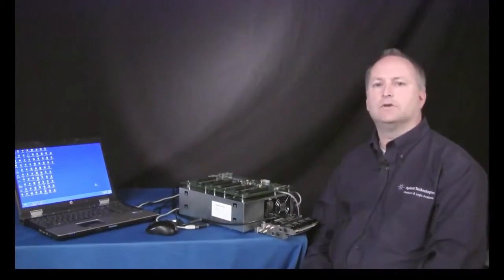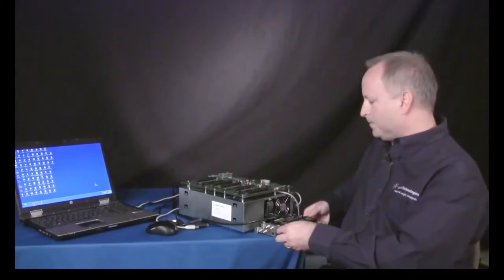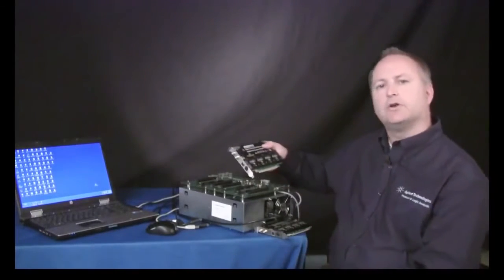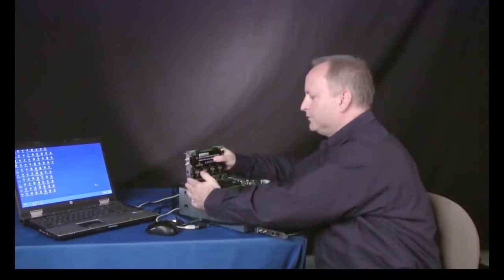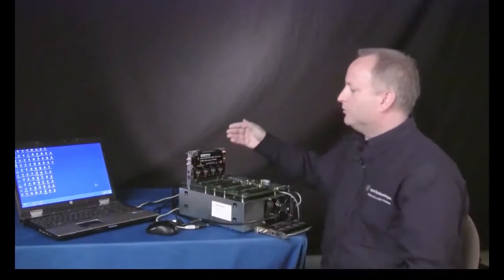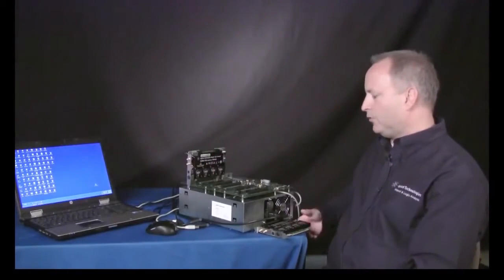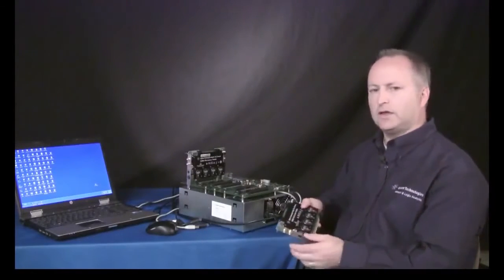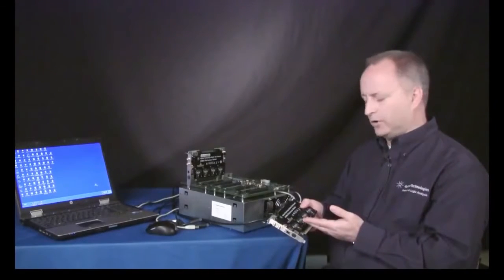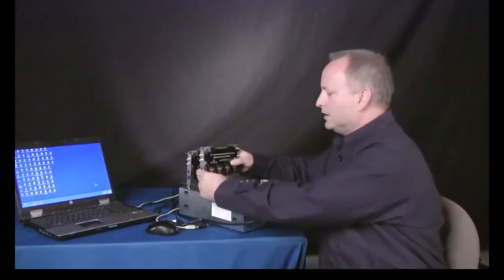In order to run the PTC3 tests, you'd use the backplane, our N5316A, as an interconnect between the U4305 configured as a PTC3. The backplane provides multiple slots for which you plug in your PTC into one of the rear slots, and then it provides an interconnect to the front slot which will be used for your device under test. For the purpose of our exercise here, we will use a second exerciser card, the U4305A, as an emulation for your PTC, and we'll plug that into the front slot.